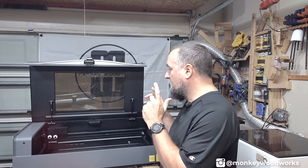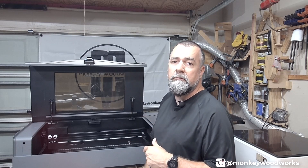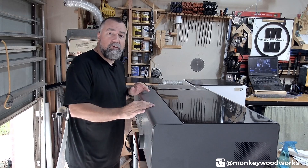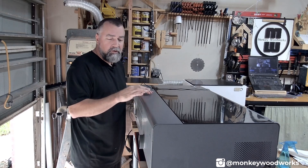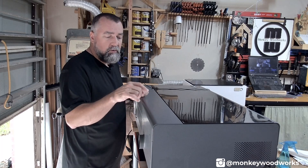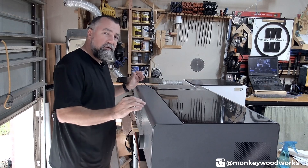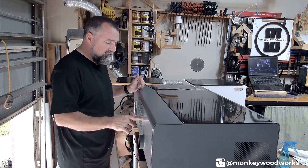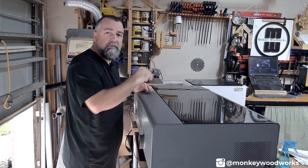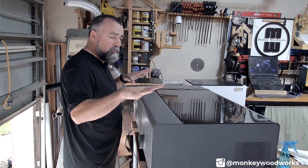Let's zoom in and start on the mirrors. First thing we need to do is go around the back and start with the back mirror. Here we are on the backside — we need to remove this lid. You need to remove this lid to clean your mirrors, and also for filling up your reservoir with antifreeze and distilled water. To remove it, first remove the five screws on the back, then lift the lid and remove the six screws on the inside. Once you remove those six screws all the way across, we're ready to remove this.